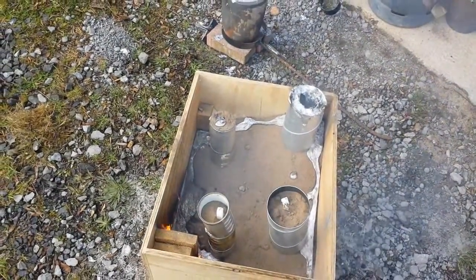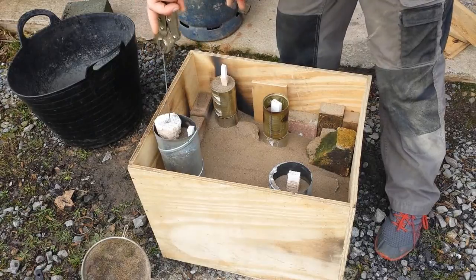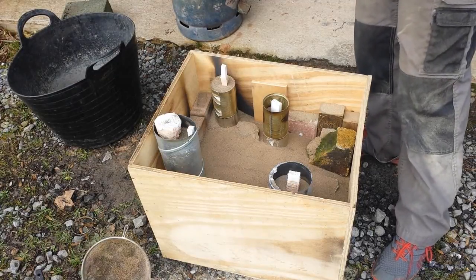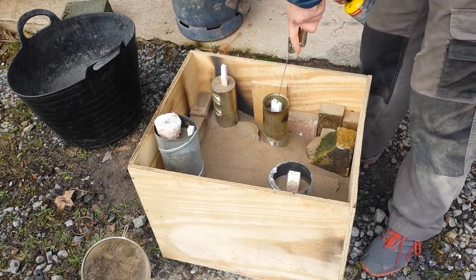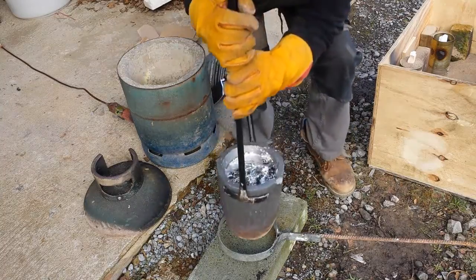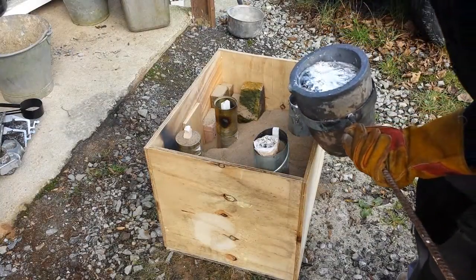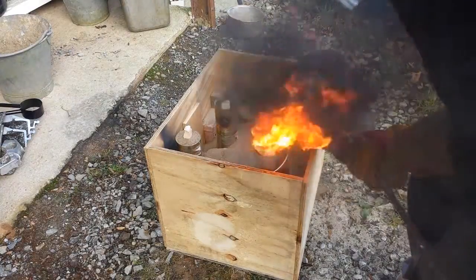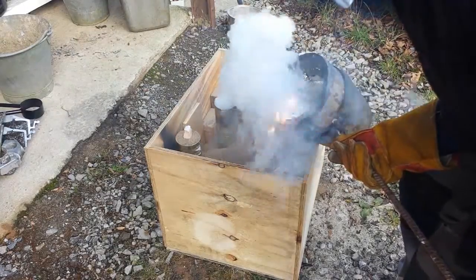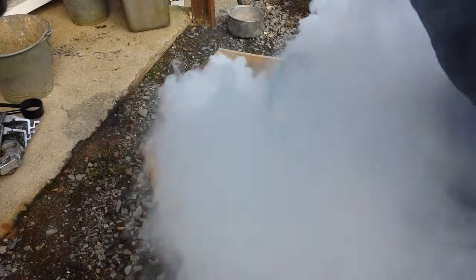I'll be surprised if that's successful — but I'm obviously pleased. So we're on to the second foam gantry end plate casting, and this time I'm pre-melting holes in the risers so they don't have to be melted before gas can actually go out of them, which I guess is the whole point of risers. Hopefully this will work a bit better. Same deal — melting, de-drossing. This time I'm also trying to have a more controlled, slower feed rate, which I've read makes for stronger castings with hopefully fewer defects.